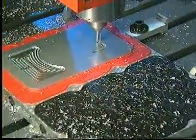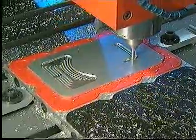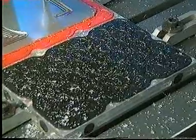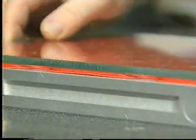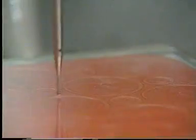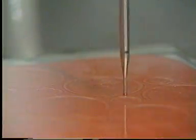Mats without holes are available to blank off large areas of the plate that are not being used. These mats are coloured black to avoid confusion. The parallelism of the Vacmat is guaranteed to plus or minus 0.02 mm, or 0.8 of a thou. The Vacmat here is undergoing inspection.